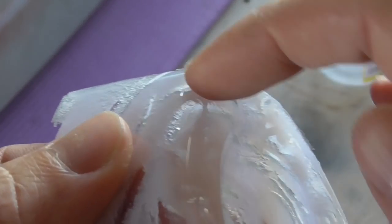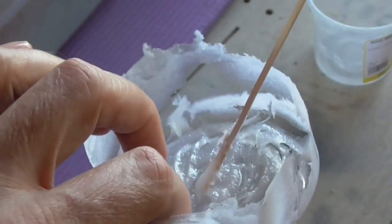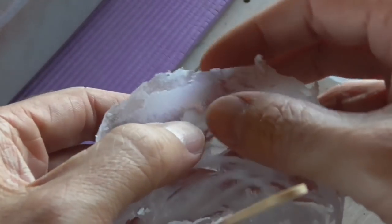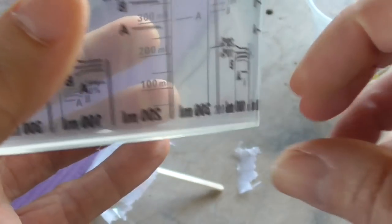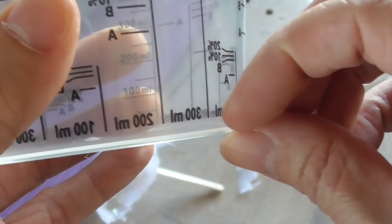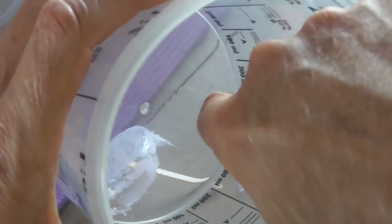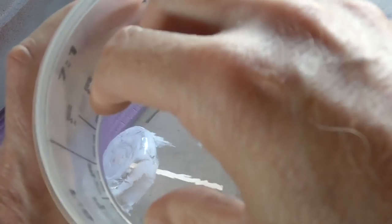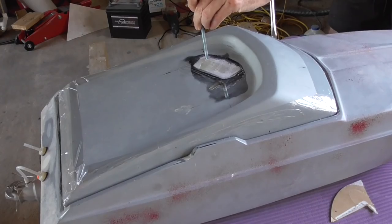See, I just pulled this out and it's perfectly dry all around this corner, which means that all the resin got mixed in the right ratio, and it's easier to pull out of the pot too, so you can often pull it out all in one piece like this, even if there's only a paper thin bit of resin in there. Whereas if you use one of these, you'll almost always find that there's a little bit of wet resin in here that didn't get quite mixed. Even if you're, you know, trying to scoop around it like that when you're stirring, you can't always get it, and it makes it harder to pull the remainder out too, because it sticks in there because of that wetness.